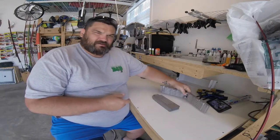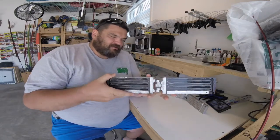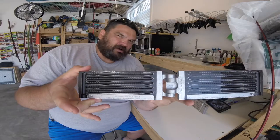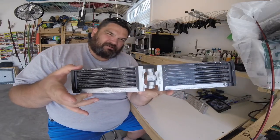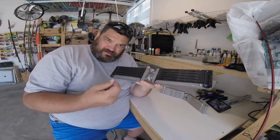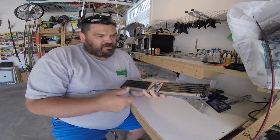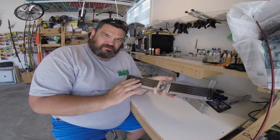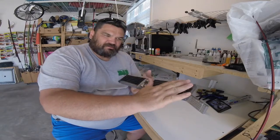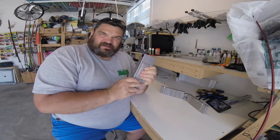What a lot of people have done as a trick — and I even did it myself — you get a high-temp paint and you spray paint the inside of the mold. Let it dry. I did three different coats, let it dry for 48 hours before I ever used it. When I shot plastic in, the baits did come out real glossy. Before that, I took a regular 240-grit sponge sanding pad and just went over the surface so there wasn't any overspray — hopefully it would sit nice and tight and flush.